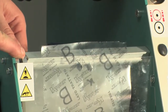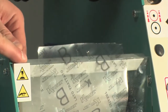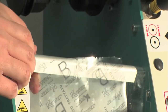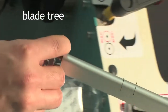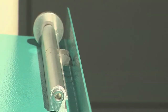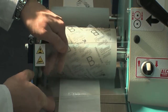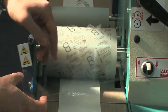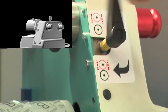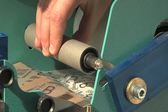Unlock the flange of the blade support shaft. Turn the shaft by half a turn and remove it. Place the blades in a safe position on the top with the cutting edge facing down. Remove the plexiglass guard by pushing on the central part. Fully lift the two infeed rollers with the help of the pressure adjustment handle. Remove the idler roller from its housing.